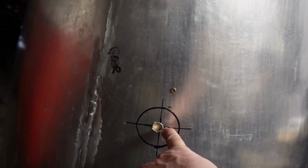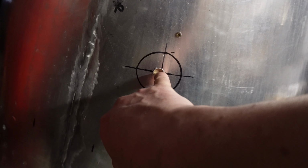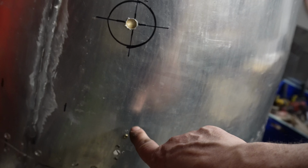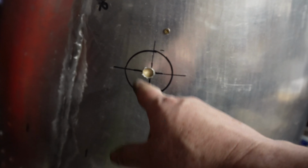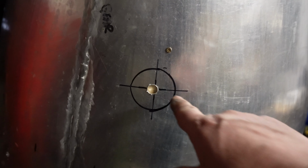Now with a hole cutter, you need something at the back, piece of wood, for the drill bit in the center to kind of latch into. So there was a hole here and there was a hole here from when I was making these, which needs welding up. So what I've done is I put a tiny screw, long thin screw through each one, and tacked a piece of wood basically to the back. And hopefully that'll last just long enough to get the hole cutter to start to establish. So it'll be a bit sporting, but I'm gonna have a go at cutting a hole there.